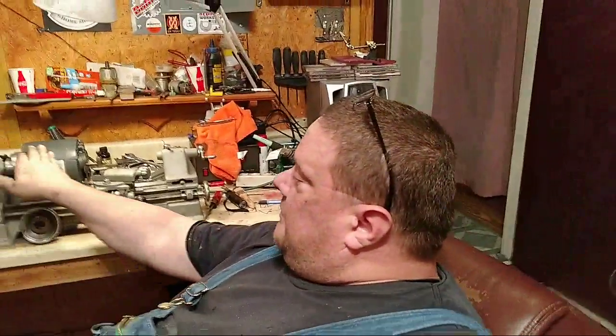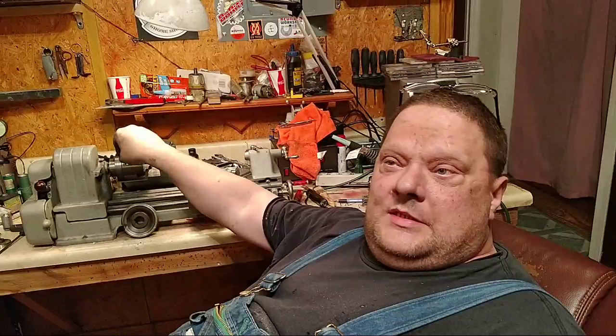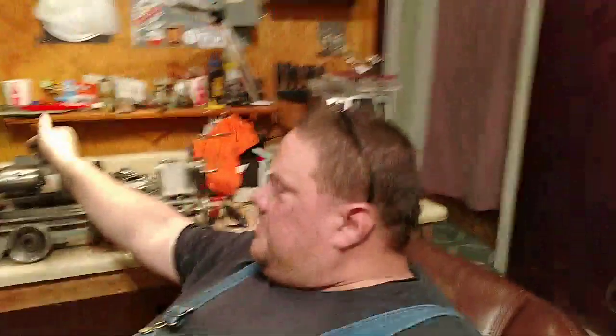But I tell you what, I am actually proud that I didn't make the chuck run any worse than what it runs at the factory. Three thousandths TIR is what it runs, with something centered up and tightened up in the chuck. And that's exactly what it ran.